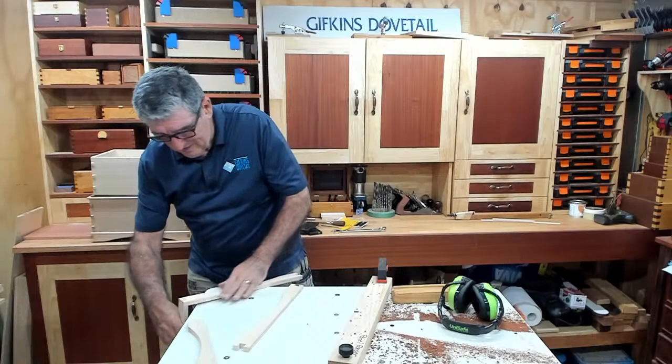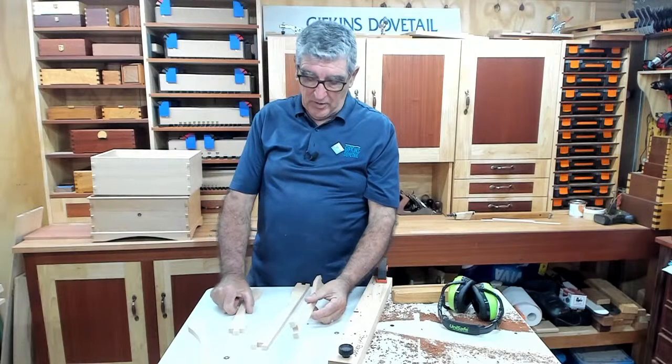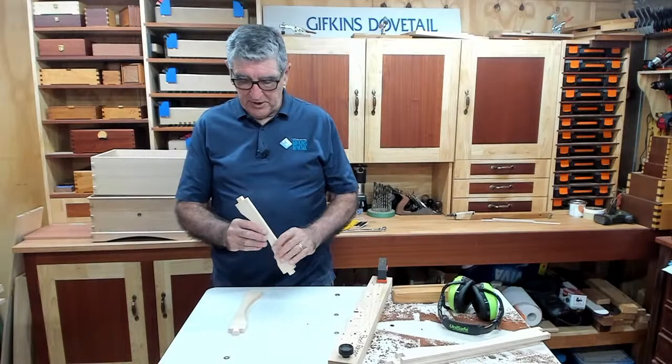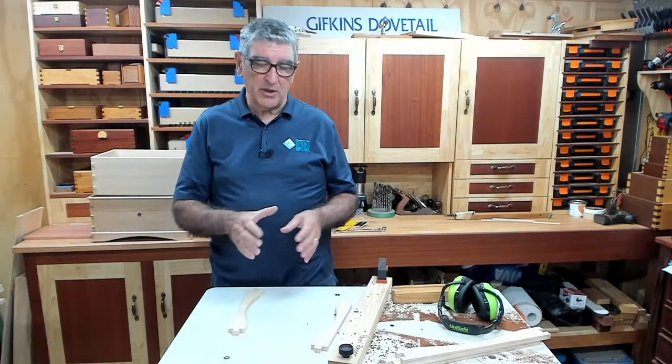Barry Wilco wants to know, when will you round over the base? The base. The plinth? When I round, Gary, usually I'll round the whole thing over once I've got the whole lot assembled. Once I've got the whole lot assembled, I know exactly where everything's going to round over. But the first thing is to get everything square. And the reason I get everything square first is because I've got square edges on everything which run up against fences, and I run other tools against it and do my measuring against it. So rounding over is generally one of the last things I'll try to do anyway.